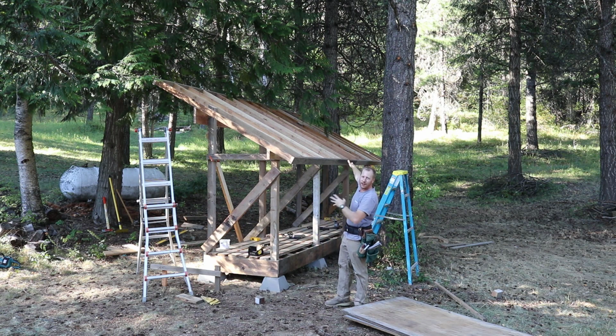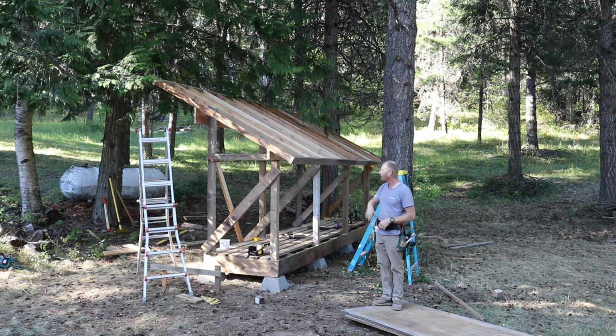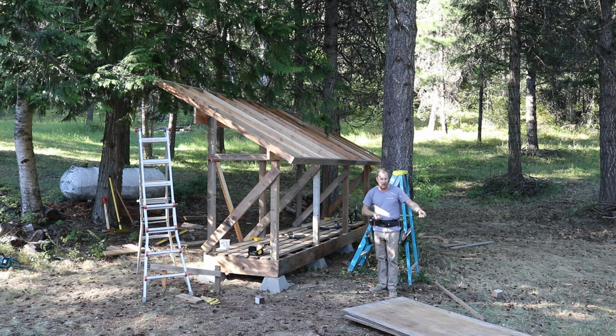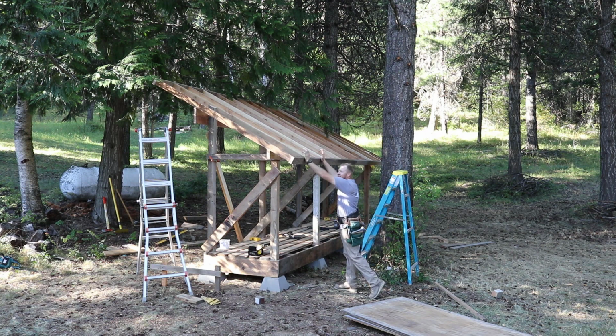We are finally moving on to sheeting the roof with 1/2-inch plywood. I've got some used plywood. It's weathered on one side, a little nicer on the other. We're going to put the nicer side down so you can see it. Sarah and I are both going to grab the plywood in the middle and set it upright, 8-foot tall, 4-foot wide, leaning against our fascia here. Then easily enough we can lift it and slide it up to the top.